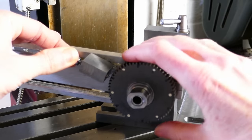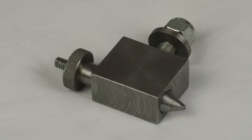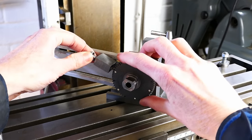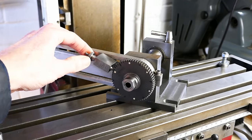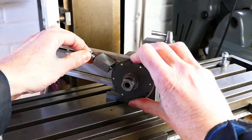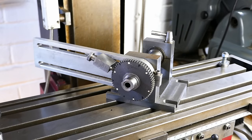This device is the plunger. It is spring loaded and the brass nose engages between the gear teeth. Basically the way the dividing head works is by engaging the plunger between the gear teeth, locking the spindle, performing the machining operation, unlocking the spindle, and rotating the spindle to engage the plunger in the next space, and so on.